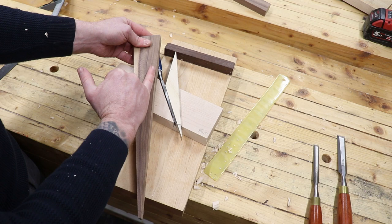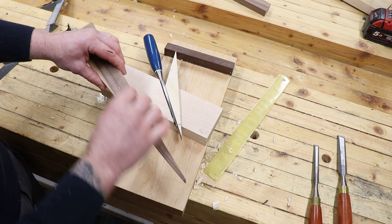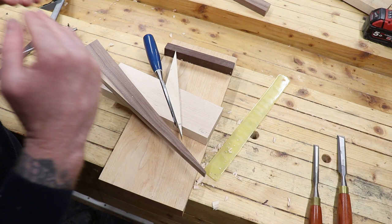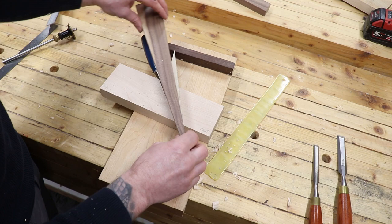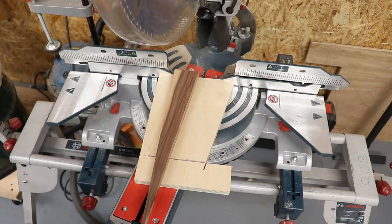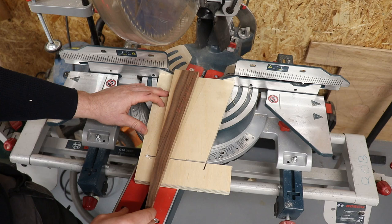What I need to do now is make this wedge piece properly. Rather than having a square face here, I need to put that 10 degree angle into it. I'm going to go to the miter saw, mark this to my one to four and a half angle, and try and put a 10 degree bevel on it. If I can't set it up on the miter saw, I might have to do it with a hand plane. I'll mark this out first, cut it, and then we'll see.